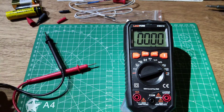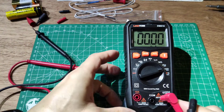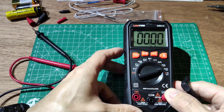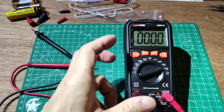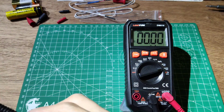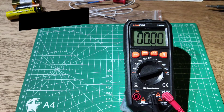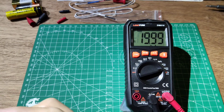The meter also has a milliamp measurement function. The milliamp range is not over 600mA. We supply a 20mA source for testing, and it reads 19.98mA — accurate to the last two digits.